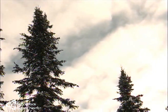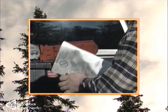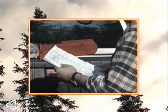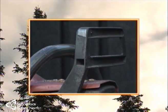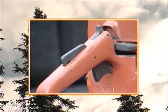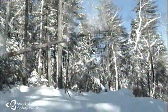To summarize the most important points in chainsaw maintenance: trust your owner's manual — it is the most reliable source of specifications, settings, and maintenance procedures, and should be kept with your chainsaw equipment at all times. Check the bar, chain, and sprocket for damage or wear. Keep the air filter and air intake clean. Test the chain brake daily — it must snap on and bring the chain to a full stop in a kickback situation, and should be adjusted or repaired by a professional. Test the throttle safety lock and make sure the chain catcher is in place. Remember that in logging operations, having a chainsaw in good working order is required by law.